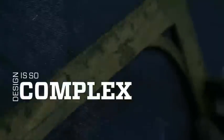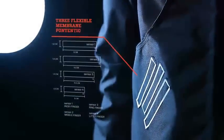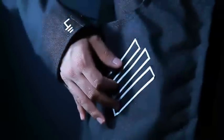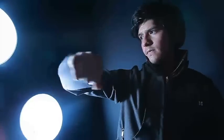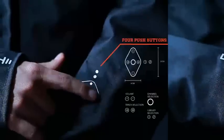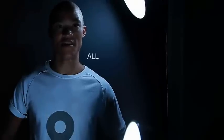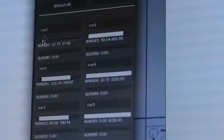The jacket's design is so complex that it can only be crafted by hand. We've included several sensors: three flexible membrane potentiometers, which can detect your finger's position; one accelerometer, which can detect velocity; one flex sensor; a joystick; and four push buttons. All of these sensors and buttons can be configured by the user, but they come with presets and initial configurations.